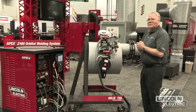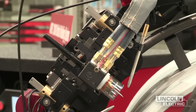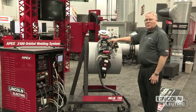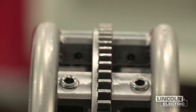The most important item we have is our first product offering for the welding head. This head is for operating on larger diameter pipe, from six inches up to infinity to flat. We've got six patents on this tractor, and the most important thing is the track design — it's a gear-driven track with a very unique patented design.